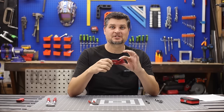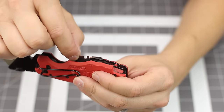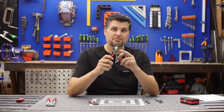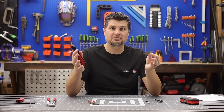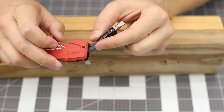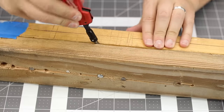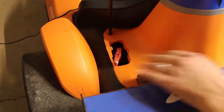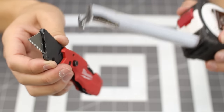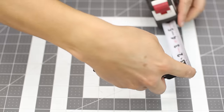On to some hidden features. The 1505 literally has a hidden storage compartment for a spare blade — I usually keep a serrated and a straight to have the best of both worlds. The bar the bit holder is connected to is so sturdy that I actually use it with the straight blade more as a pry bar than a screwdriver. Also, there is a little groove right next to the blade — that's by design. It's a perfect groove for the end of a tape measure to score drywall.